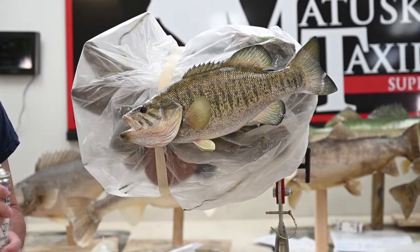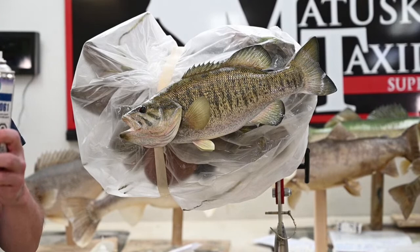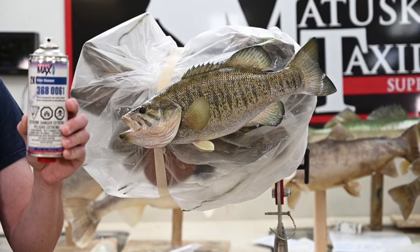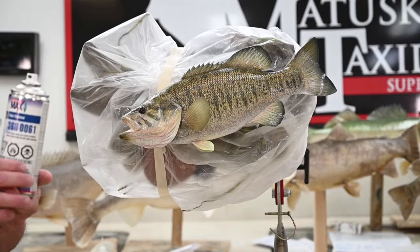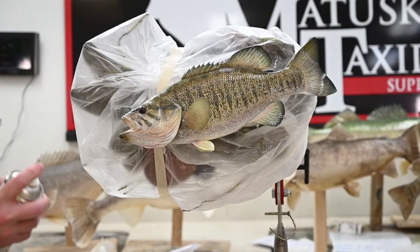Now, once you puncture that can, is it a goner after today? Not after today. It will eventually be a goner just because the catalyst acts on the can. I think the can says 48 hours. We've done nearly a week, if not a week. I wouldn't recommend that. Try to get all of your projects lined up so that you're within a day or two. But we had really good success several days later. I know you kept pulling the can out of the garbage and spraying it, and it kept working. But that's probably all we would want to do with the first coat.